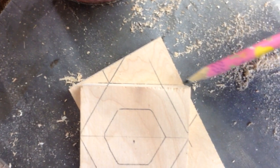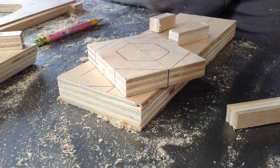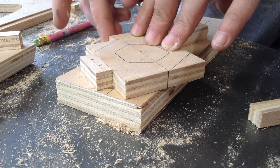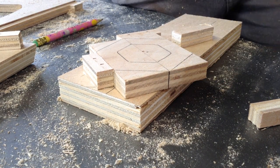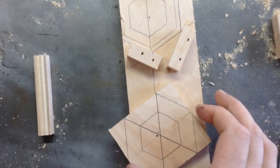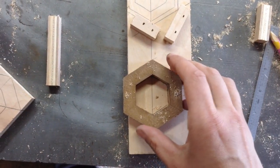When the marks line up on the edge of my cutout square with the lines on the jig, I can put a brad in here and then put some stops in place. This was very easy to figure out — it took me about 20 minutes. The pentagons were much harder because there are two separate angles to deal with, but this one was pretty easy. I put some stops in place so the piece can't move around, and then I could do a test cut. One mistake from the first time was that I didn't originally have this center line, so I fixed that the second time around.